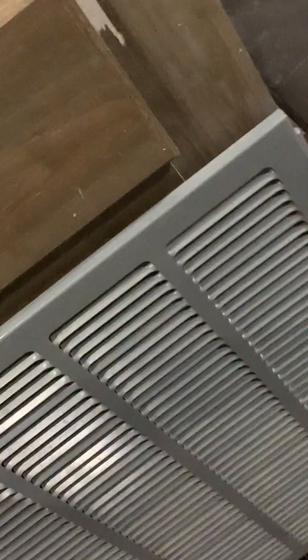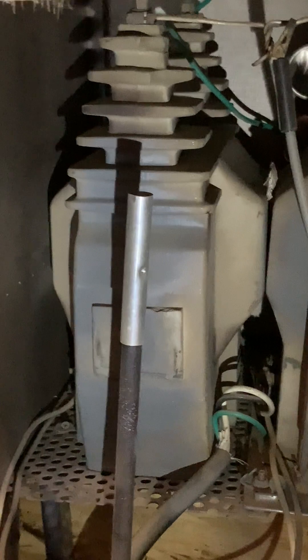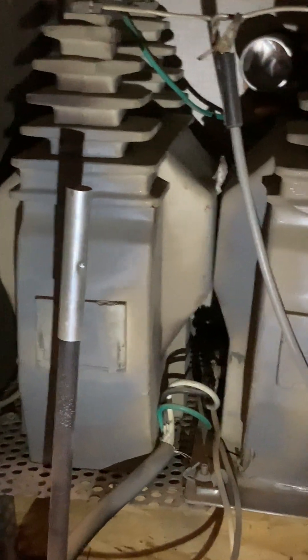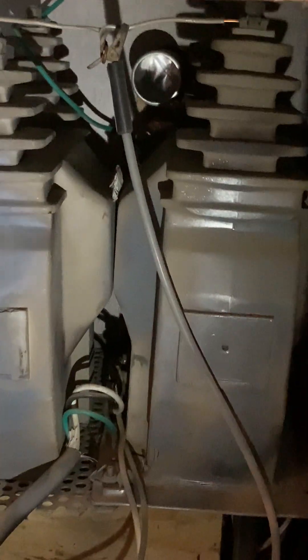I've done another video similar to this that I took down before, but I was getting my power by a not-so-legal method. Here's the bank of transformers — using two potential transformers, each one rated 1.7 kVA at 7,200 volts. The reason I'm using two is in the event that I want to go camping and the lines nearby are of a higher voltage than 7,200, I can wire the tops of these in series for a little more versatility, plus I get increased capacity.